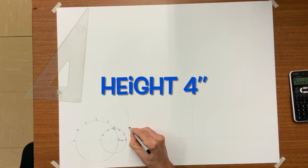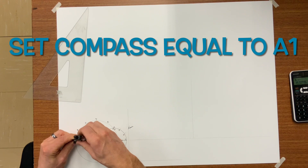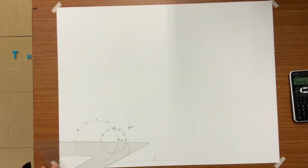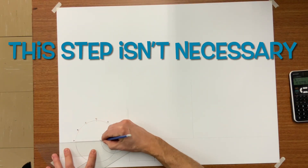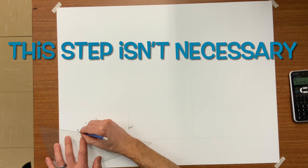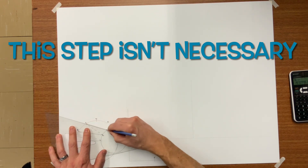On your sheet, draw a 90-degree angle close to your working view. This 90-degree angle will represent the height of the fitting, which is four inches. Then on the baseline we need to take all of these element lines — like I am doing with A1 — and bring them onto the baseline. Scribe an arc and mark A1.